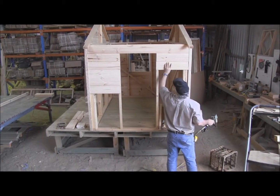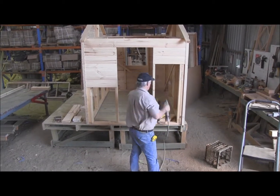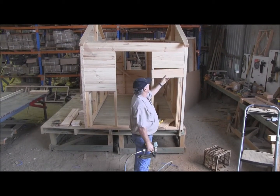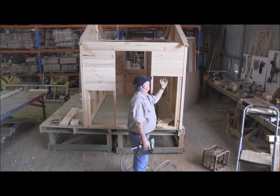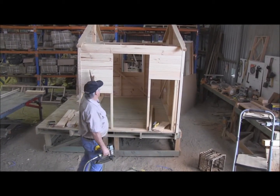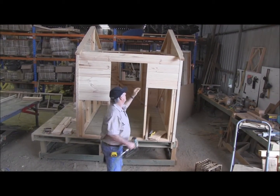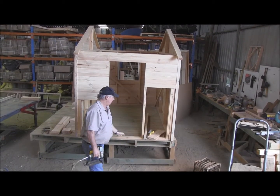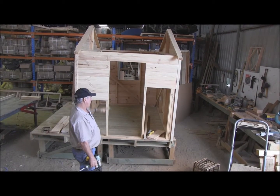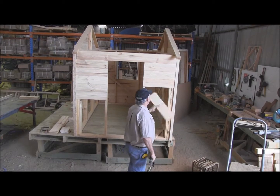So this is exactly the same. The right hand side and the left hand side, normally on a cubby, are done in the same way — except if one side has a window and the other side doesn't. If this side didn't have a window, we would then use longer boards and go straight across. You would often then only have one upright or one stud in the middle of the frame and would just come completely down the wall. Same cladding, same principle.